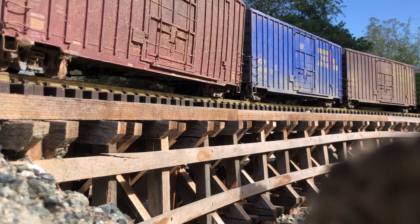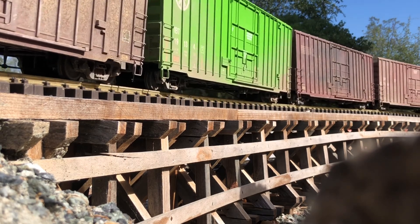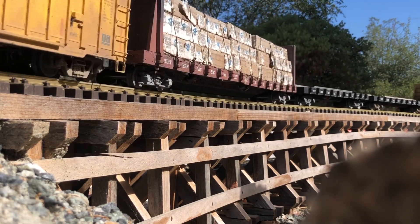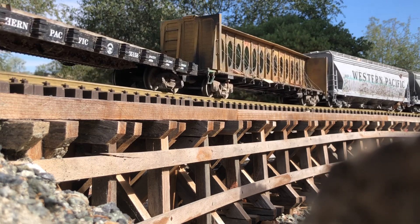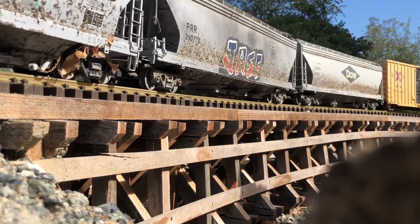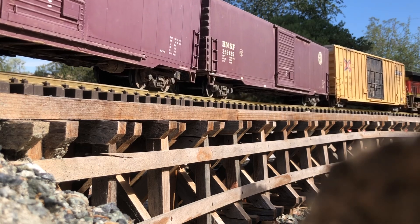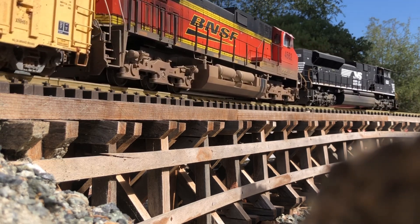Now for those of you rail fans that are familiar with railroad jargon, there is a difference between manned helpers and DPUs or distributed power units. In the case of a DPU locomotive or locomotives, these are generally placed on the rear end or sometimes the mid portion of the train and are controlled via remote control by the head-end locomotive. A manned helper locomotive or locomotives are operated by a completely separate crew than the head-end locomotive, meaning there is generally an engineer and a conductor on a manned helper that actually operate and control that locomotive's speed, rather than a distributed power locomotive or DPU, which is operated via remote control by the head-end locomotive engineer.